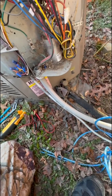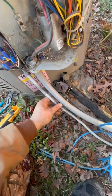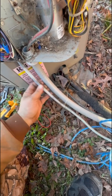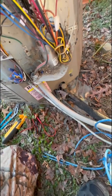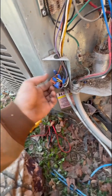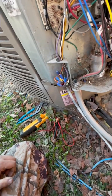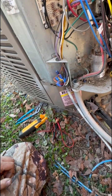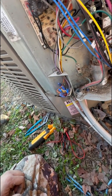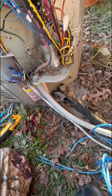I'm wondering if that water is what blew the fuse. I'm leaning towards that because I think it saturated the wires and probably just put too much load on the transformer. As far as it kicking on and off, we got that fixed by re-stripping the yellow wire and putting it back together — it was not making good contact. We're going to go upstairs, and if we don't see anything else, we're going to call it that water in the thermostat line.